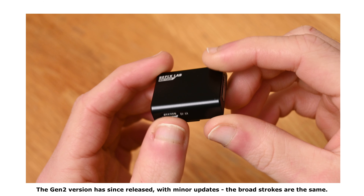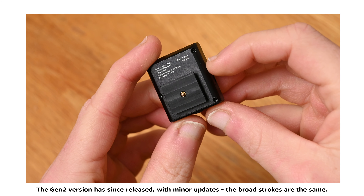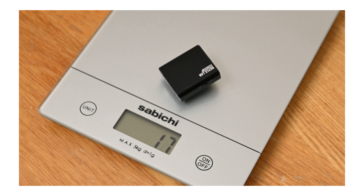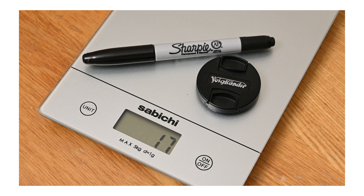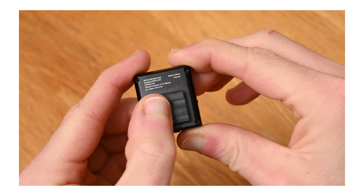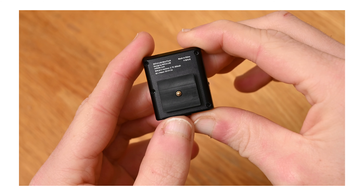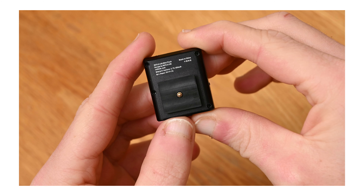The housing is made of anodized aluminium and it's absolutely tiny, just 33x29x17mm in size, and weighing 18g. That is frankly nothing. It's powered by an internal 65mAh rechargeable cell that should give more than 200 flashes on a single charge, with a colour temperature of about 6000K. So it's slightly more blue and cooler than daylight, but not to any significant degree that you need to worry about.